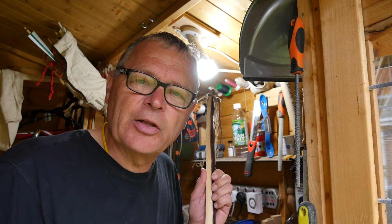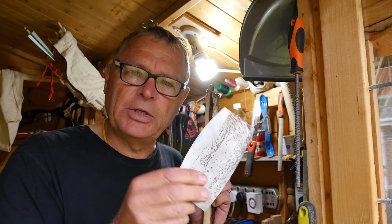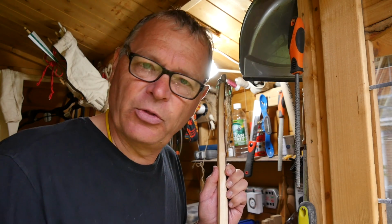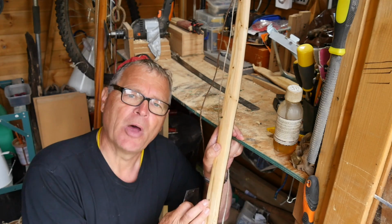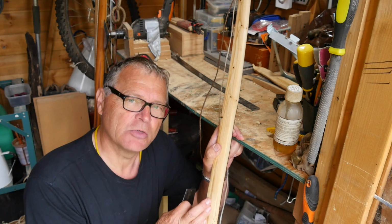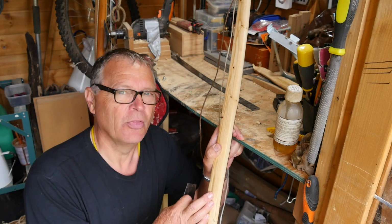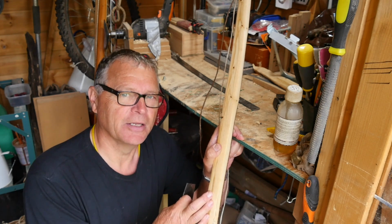It's raining heavily at the moment, so I'm taking this opportunity to remove the tooling marks using a cabinet scraper all the way up and down the length of this Blackthorn bow. Now my measured draw length is actually 27 inches, which means a further 6 inches of draw on the tillering post before this bow's ready, and those 6 inches are going to be really nerve-wracking.